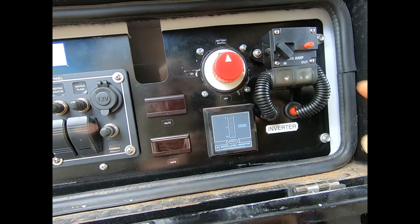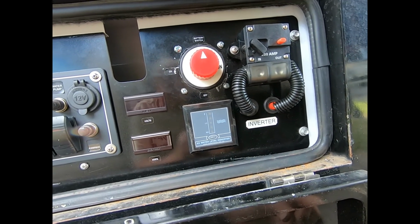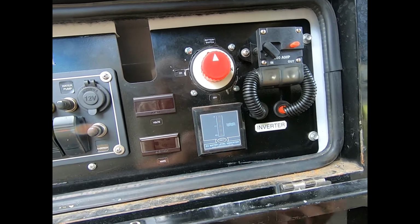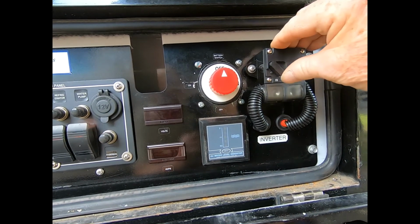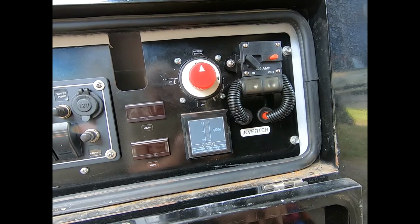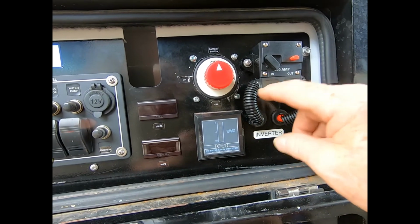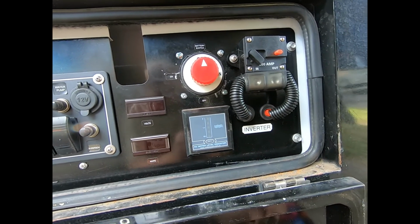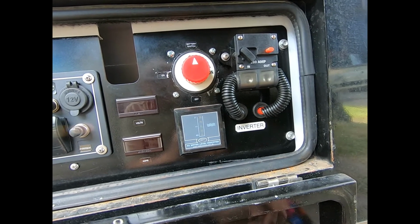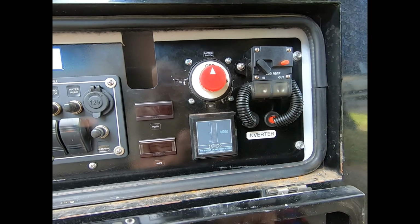inverter. I put a 200 amp in there because I can only get 120 or 200, and 120 may not have been enough. I'm mainly using it as an isolator, but it will still protect the cable going through there. But that circuit is already protected from the battery anyway, so it's doubly protected with the 125 amp fuse and that.